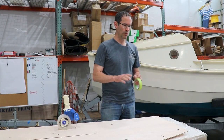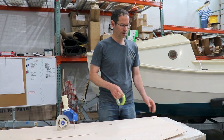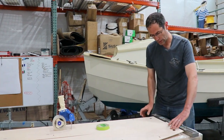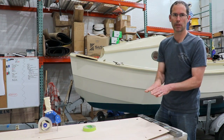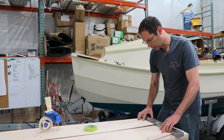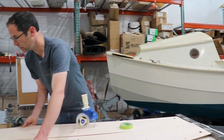So we're getting ready to glass the interior of the bottom planks. You'll notice that it's two pieces, which commonly means that a boat has some shape to the bottom — a little bit of a V. Not so with the portage pram; it's a flat bottom boat. The critical things here: one, we obviously want to make this joint down the middle disappear, so we're going to get it firmly together, and also ensure that we're not misaligned fore and aft. I'm just going to put a level back here to give us something to positively bump into.